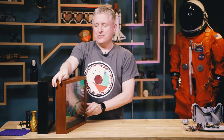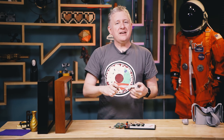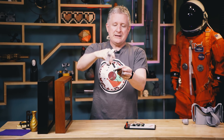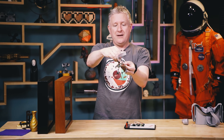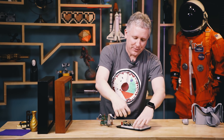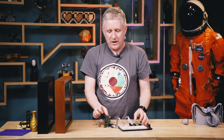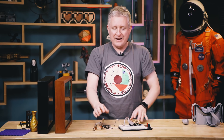I love these things — they're on my wall at home. I tried lighting them up but couldn't find a good solution, but they work great just as they are. Number three — this one I'll make quick because it's not for everybody. It's a test clip for surface mount chips. If you have a surface mount chip you're hacking on with like 16 pins, you don't want to solder wires to every pin. Well, they make these clips — you just clip it right onto your IC and plug it into a breakout board on your breadboard, and you're done. You've got hookup wires to whatever pins on your microcontroller you want, and you're hacking away reading every signal just fine. I had no idea they made these — I was hacking away at an RC tank and this changed my world. Thank you to Zach Radding for letting me know they exist.